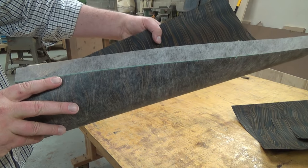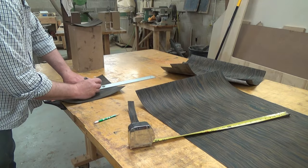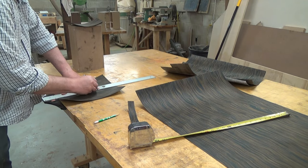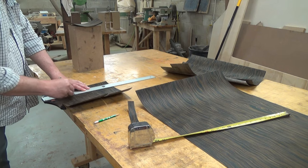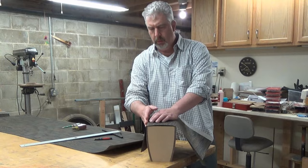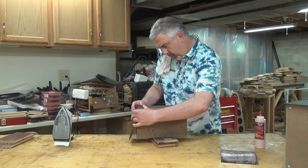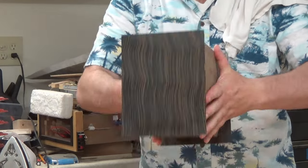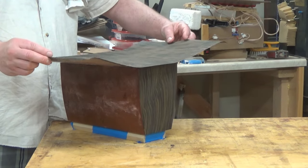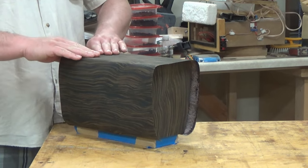With that said, it's time to veneer the cabinets. I used a very thin, fleece-backed veneer that I purchased from AliExpress a few months ago. I've used a similar fleece-backed veneer before on the Epic subwoofer build, and I really liked using it, so I'm going with it again for these. The process is fairly simple. I'll veneer the back first, then the top and bottom at the same time. And then the front and sides in one step, thanks to that 3/8-inch roundover I put on there earlier.